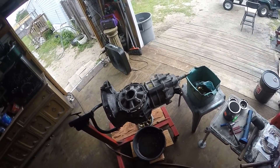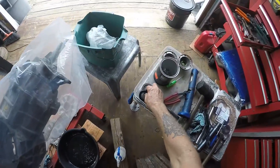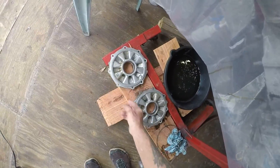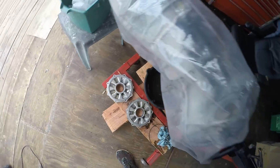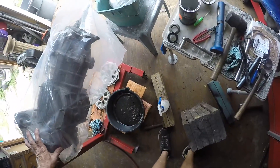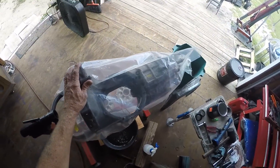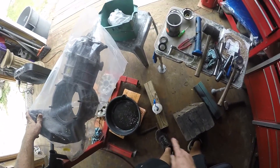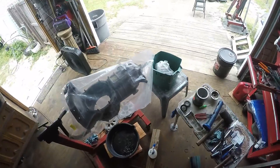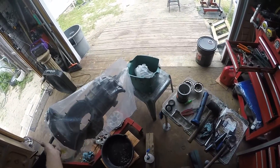Now I can replace the seals and put this bad boy back together. I got the seals out. Got this all cleaned up. That one was catty-wopped. I don't see any bad teeth or anything on the gears or on the chuck, so we'll see — looks pretty good. Clean everything up, let it dry, and install the new seals. Then I'll close it up, and the last thing I'll do is the tail shaft bushing.